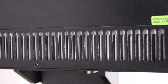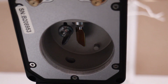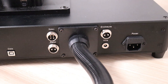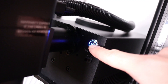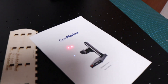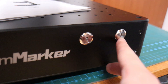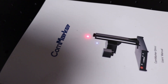The air-cooled UV laser generator is mounted on top and connected to the Galvo head. The Galvo head contains two mirrors that can move extremely fast and precise, and are used to direct the laser beam on the surface. At the back, you'll find connections for the rotary attachment, enclosure, foot pedal, and the Z-axis column. After turning on the machine, you also need to activate the laser source, which takes about a minute to heat up to operating temperature. Once it's ready, the button stops flashing, and a blue dot appears on the surface. The Galvo head has two laser pointers for focusing, and the machine can be focused manually or electrically.